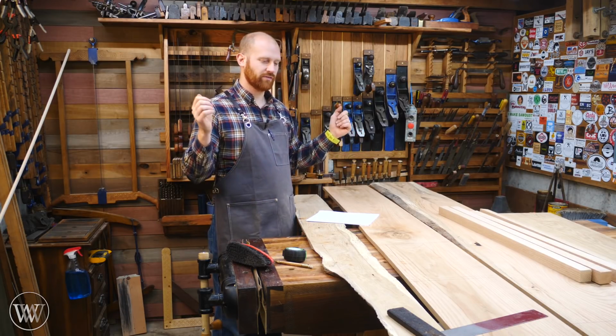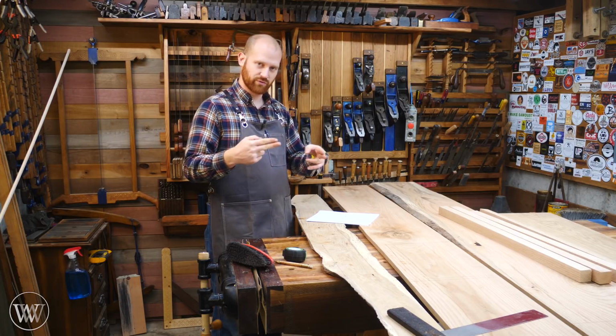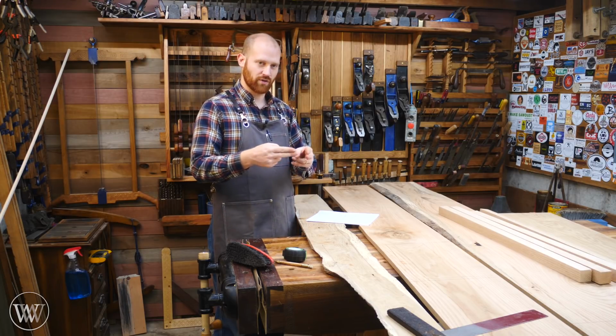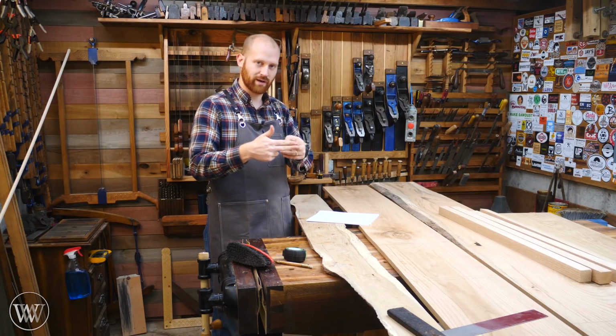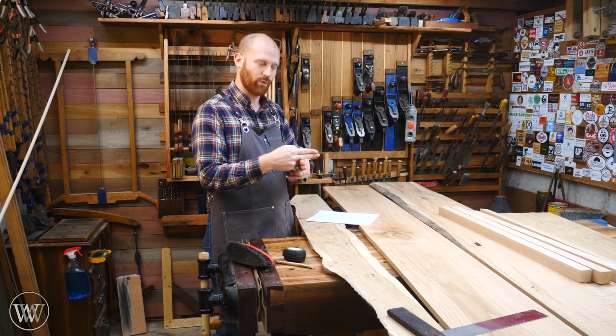So dovetails, drawbore tenons, all of the tenons are going to be through tenons that are drawbore. The stretchers are actually going to have passing tenons. So they're going to be full length inside the leg, and then where they cross, rather than butting into each other, they're actually going to pass each other and stick out either side. So one goes high and one goes low.